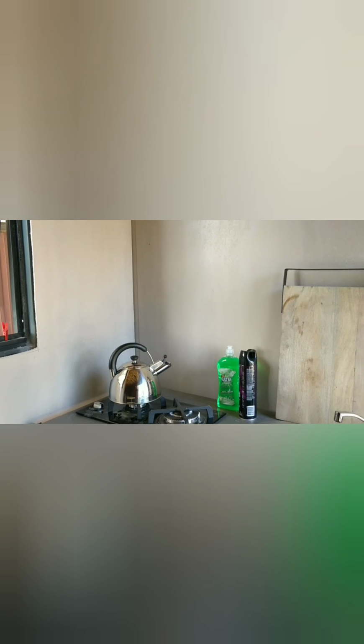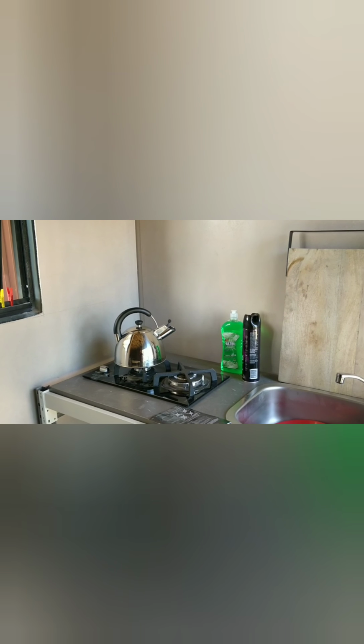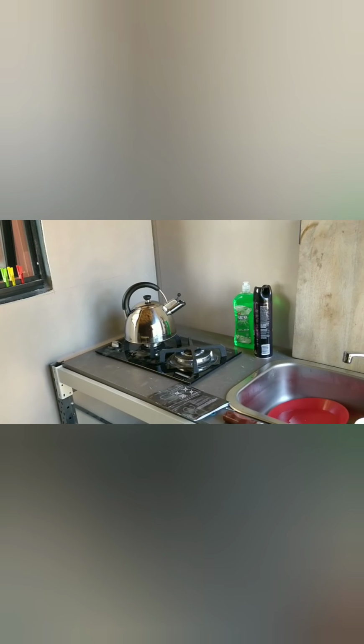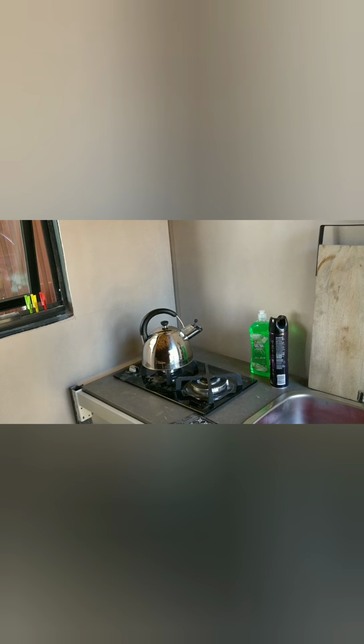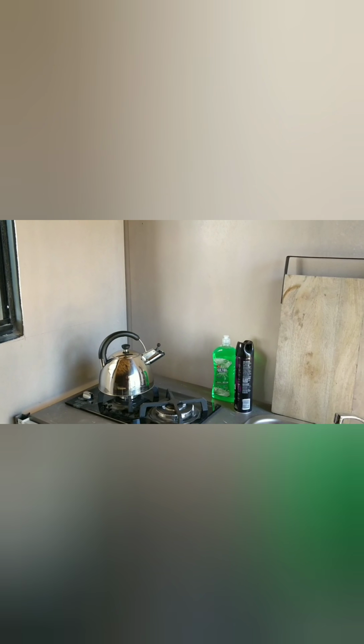Because there's no doors in this tiny house apart from the door on the bathroom, it's considered one area. So by Australian or Tasmanian spec, there has to be a vented range hood. That's the cabinet for that sitting there in its box that will go 700 off the top of the burner and hung on that wall, and then vented out that side wall there. So that's tonight's job before I can actually have the gas signed off.